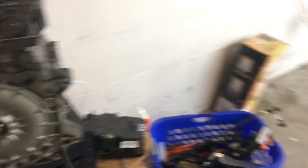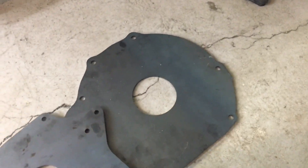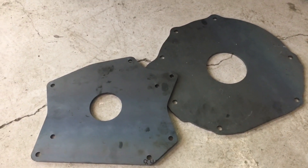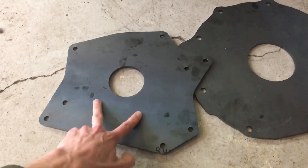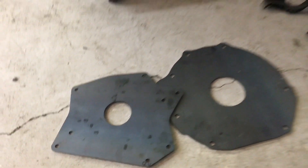There's one plate, and what we're going to do is put this to the transmission, this to the Leaf, then put our coupler on the shaft and line the motor up with the transmission. Then we'll weld some square steel tubing here and here, spot weld a couple spots so it's all in place, then pull it off both motors and weld it all up, seal it up good and strong.